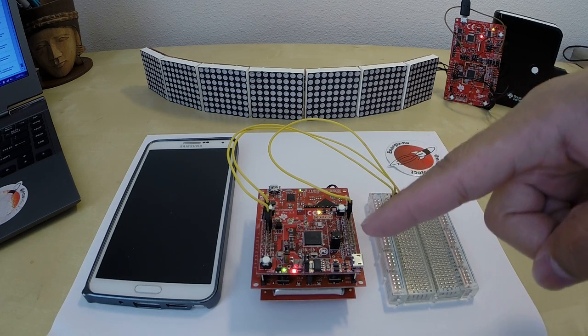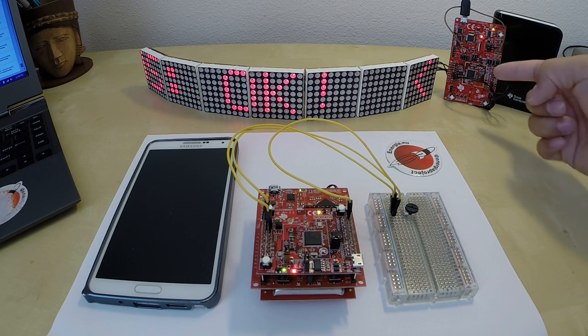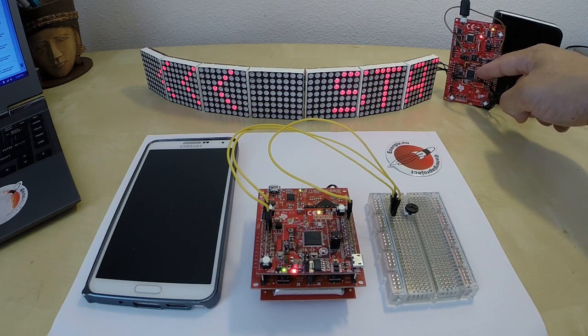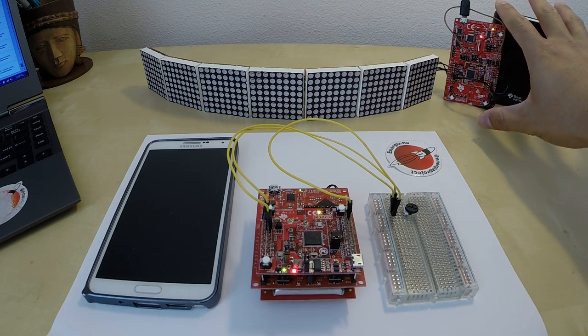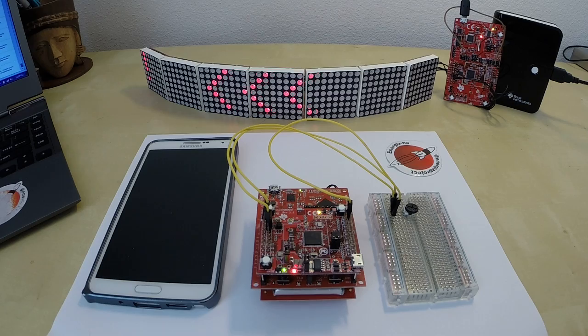In this particular instance, I required two chips — the MSP430 and the Wi-Fi transceiver. On this particular board, however, it's just one chip, the CC3200, which features both the ARM MCU and the Wi-Fi transceiver. So you can actually see that this Launchpad is hooked up to these 8x8 LED matrices, and it's just displaying a message basically saying that the position of the potentiometer is okay.